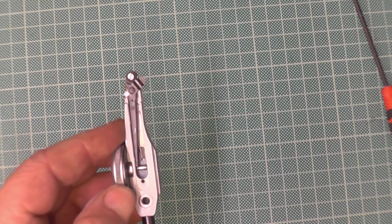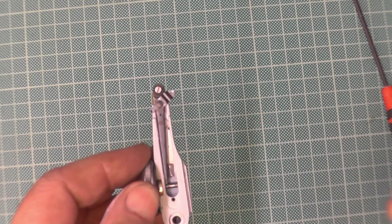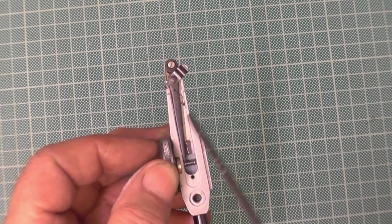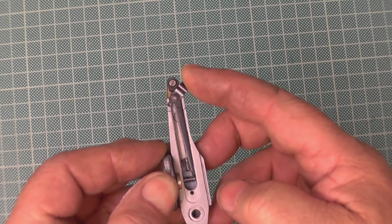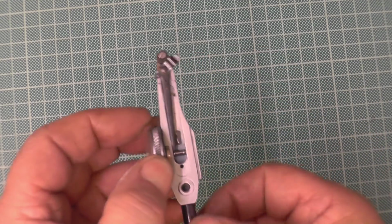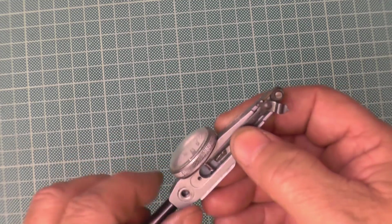Now I'll get this one, and that's what it roughly looks like on the inside. It doesn't have a little lever because again all these levers end up going missing, but it works the same way. There's the helix, a little screw thread in there, so when I move that, it moves the helix, which in turn moves the hand on the front. I'm not going to show you the hand on the front yet. And then where that pin is, where the wobble should be for the spring, you turn it and it goes the opposite way around.